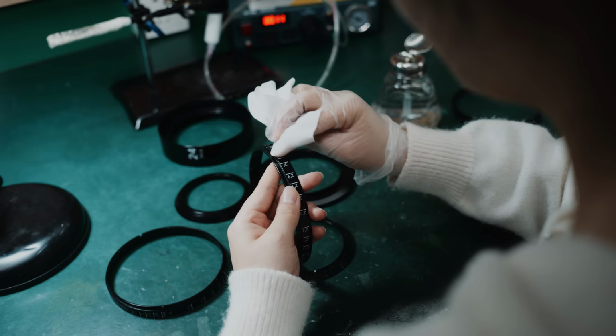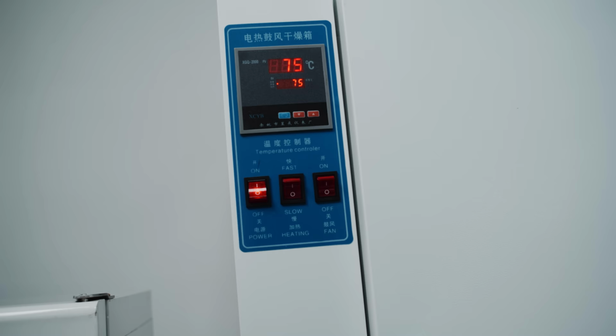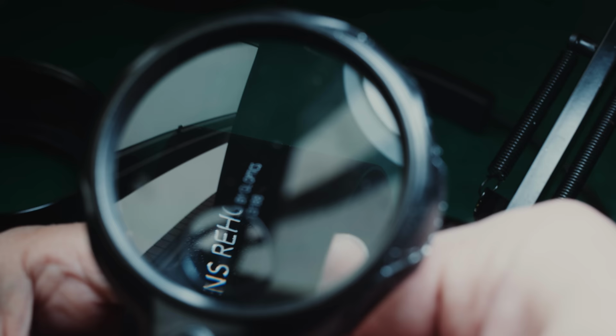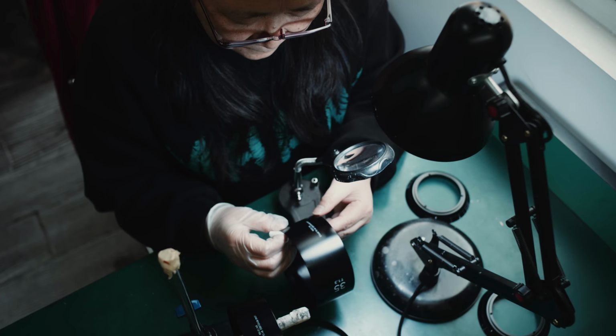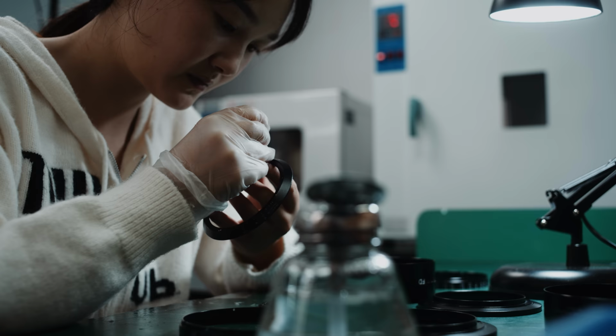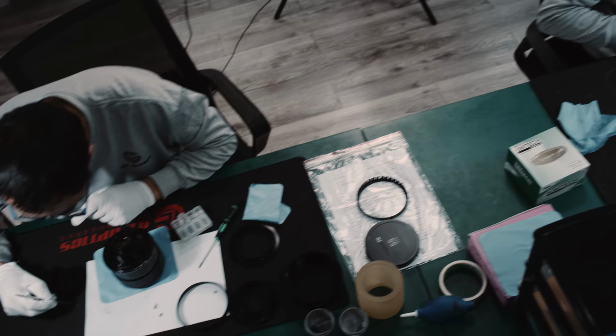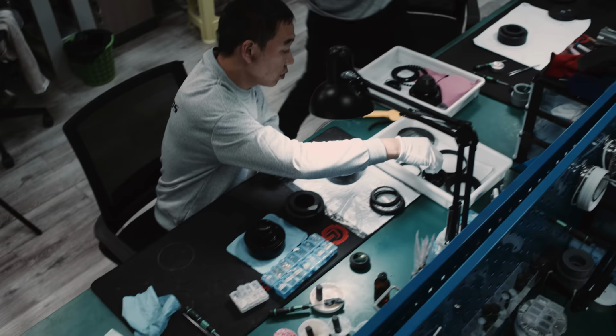Paint is baked in using an oven, making it hard and permanent. Drying can cause tiny cracks in the paint, and every number, mark, and letter is checked after baking. If there are any flaws, they are mended, and the baking is repeated until the paint job is perfect. All parts are ready for the final assembly now.